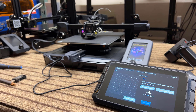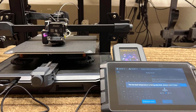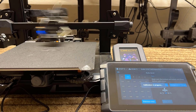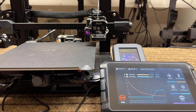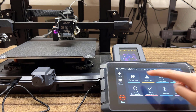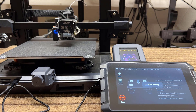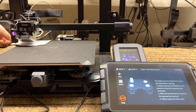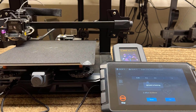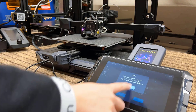It's now going to do a 25-point probe. I will preheat the bed to 60 degrees Celsius first, and then start auto bed leveling. Now it shows everything is done and displays the main Klipper screen. Select manual leveling to redo the leveling of the four corners that was skipped during the setup process. After auto home, when I click on the first point, it will move to the front left corner, but this time since the Z offset is set, the nozzle is no longer a few millimeters above the bed. I will just re-level the bed and re-adjust the Z offset.